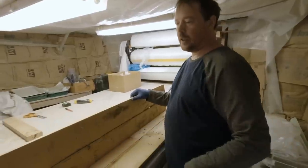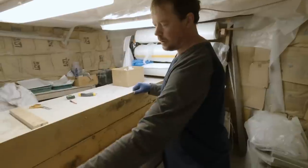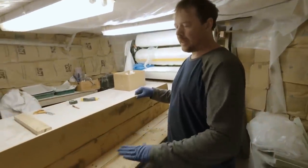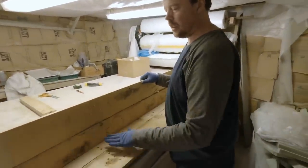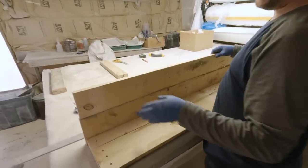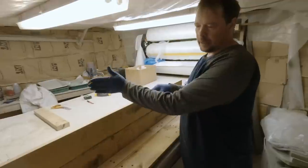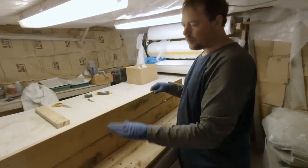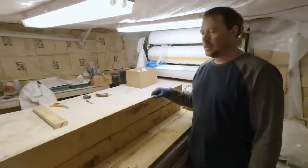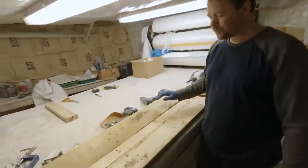And then when we go to fill the voids with foam, we'll fill it almost to the top of where these will be, and then we'll just cut some holes in here with a hole saw and just pour in the rest. And allow that foam to expand and fill any remaining cavities. It'll be able to come out the back side of this because there's a gap between where the form will be, or the sump, the sidewall of the sump, and the concrete that's in the fish hold right now. So that'll allow it to expand up and out and fill that void along the top. And then we'll just come back in and we'll build it up. Pretty simple. Good plan.